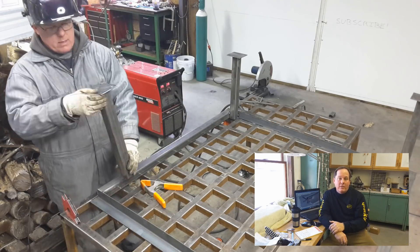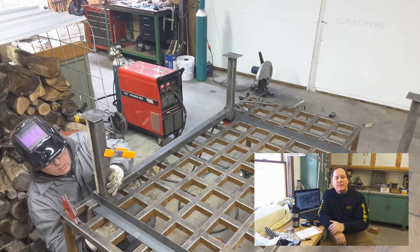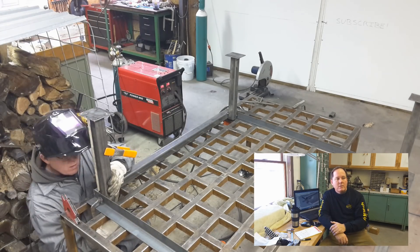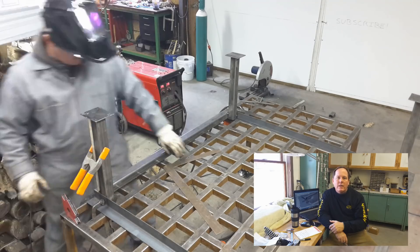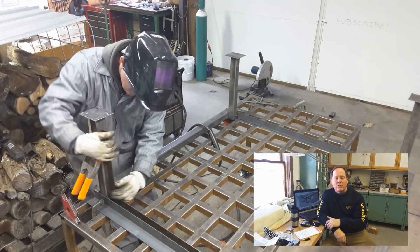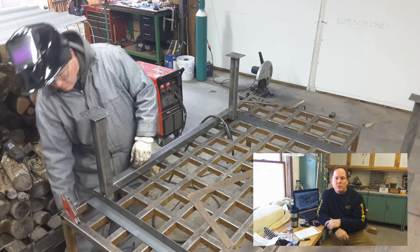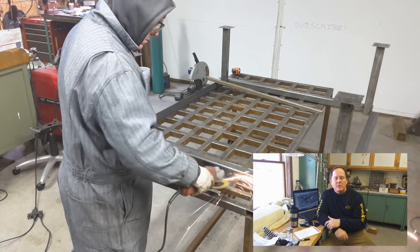The overall table height to the level at which the pieces of sheet metal are going on is going to be 30 inches — the height of your average dining room table, and there's no need to have it any higher. This isn't a workbench, and it will make loading sheet metal onto it pretty straightforward. The table on this machine is going to have a 48 inch capacity in the X-axis, and like my router, you can slide anything in because it's open end to end, with a 48 by 48 working area. The physical size of the water tray is going to be 52 by 52, allowing some tolerance for where the sheet metal is put and not running right up to the edge of the water tray.